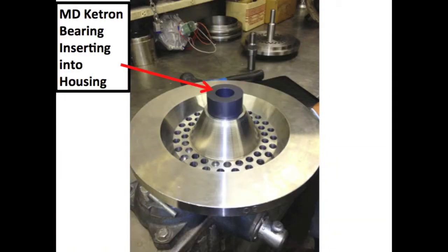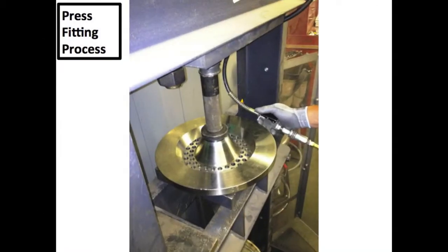This is the day we actually tested and press fit the bushing into the extruder assembly. Here we are testing that the press interferences were correct. Here we show the press actually being fit at the time. It went in with the correct amount of interference press fit so the bearing would not spin in the steel housing.